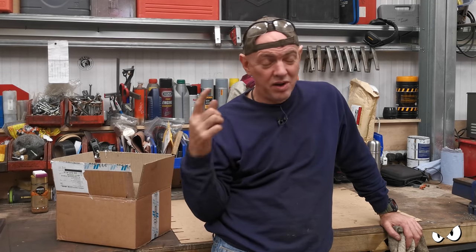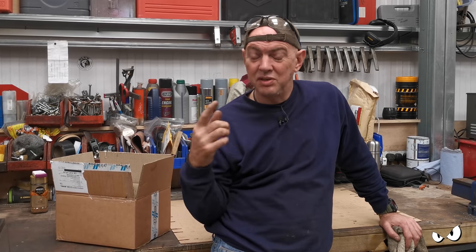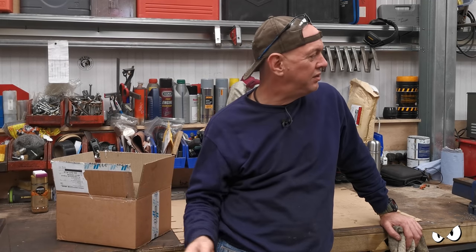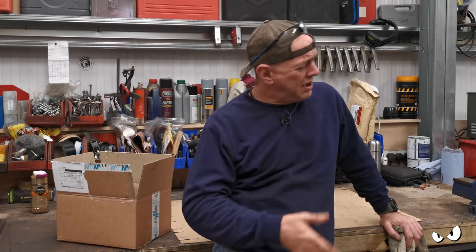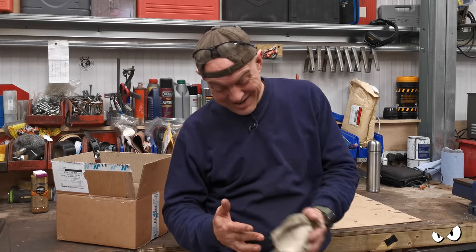but because we've only got that single capacitor in there, we are losing torque out of the motor. So as you go for the higher speeds, the spindle speeds don't pick up to it, because it's always chasing the phase sort of thing. So that's coming, but you don't need to see that. It works, it goes, I can start using it.